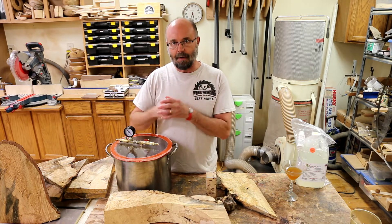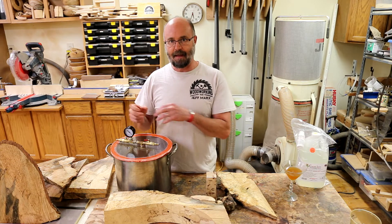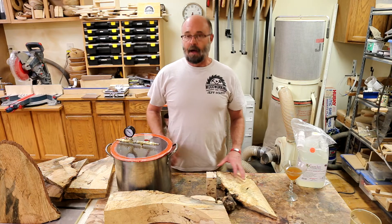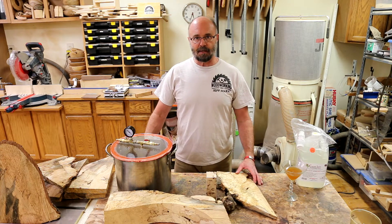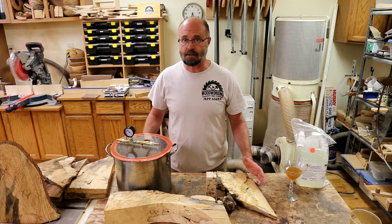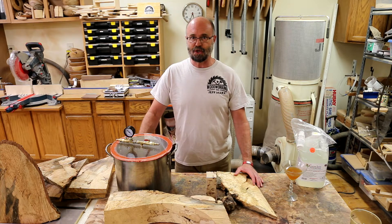These will go in the oven to dry to drive out all the moisture before they go in here. The vacuum gets pulled to pull the resin into all the pores, then that goes and gets heated to polymerize it and set it up. Please enjoy — certainly if you like this there are other folks who have done similar videos that are excellent learning sources. Thank you for watching.